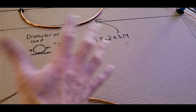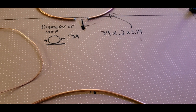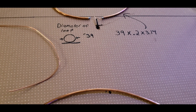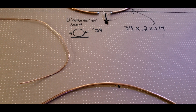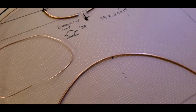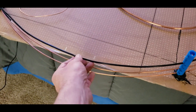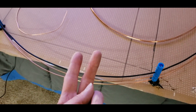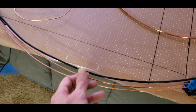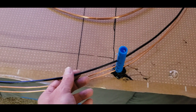You take your diameter and you kind of want to make it resonant on the frequency you're going for. At 39 inches, it hits about 12 meters, 80 meters, and close to 40 meters with some resonance. This was cheap to make — I used house wire, three-conductor, cut the sheath and ripped the wire out. I used the ground and black conductors.